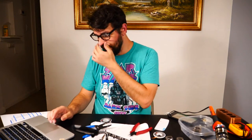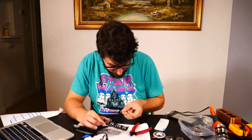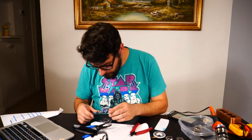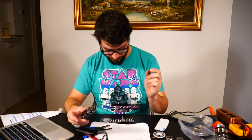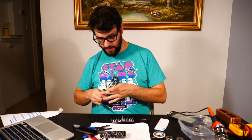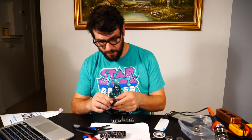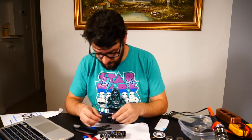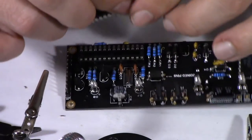Tube test — the clock is now ready for final powering up. Before I do that, I still have an un-soldered 100nF capacitor — let me check the boards carefully. I think it's good. Insert the four tubes, then assemble the two PCBs together ensuring the four LEDs go into the holes in the tube PCB. Important tip from another video I watched: someone forgot to put IC2 back in after the high voltage test. We took it out — remember to put it back in. The instructions do not remind you to do this.